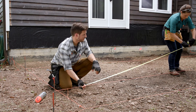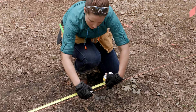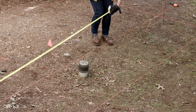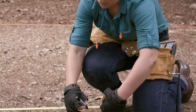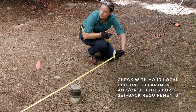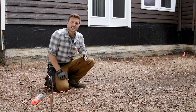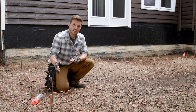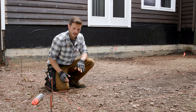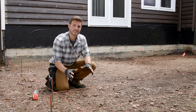Now we're measuring from the center of this post to the center of our next post — seven feet nine inches. And then the same again, seven feet nine inches to the center of the next post, which puts us at 15 feet six inches total. We can see the utility marker right here, but we are more than two feet away, so we're in good shape. Our last post location will be flush with the other edge of our frame. After marking all posts on this beam, we'll do the same process on the beam behind us, then extend all these marks down to the ground using paint to mark the center of each footing location.